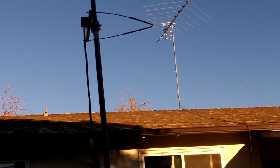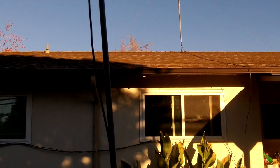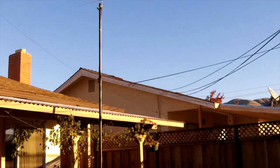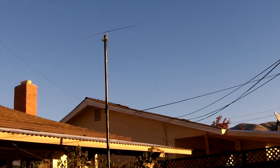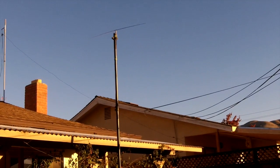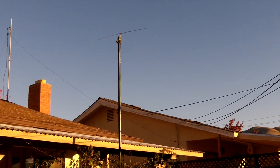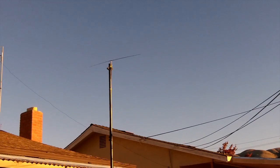So it's aimed up very slightly. And that's one reason I put the dipole over here above the antenna for the measurement. That should also mitigate some of the reflections off the ground that might occur, since this is horizontally polarized. And I think the results sort of support that this is a good approach.